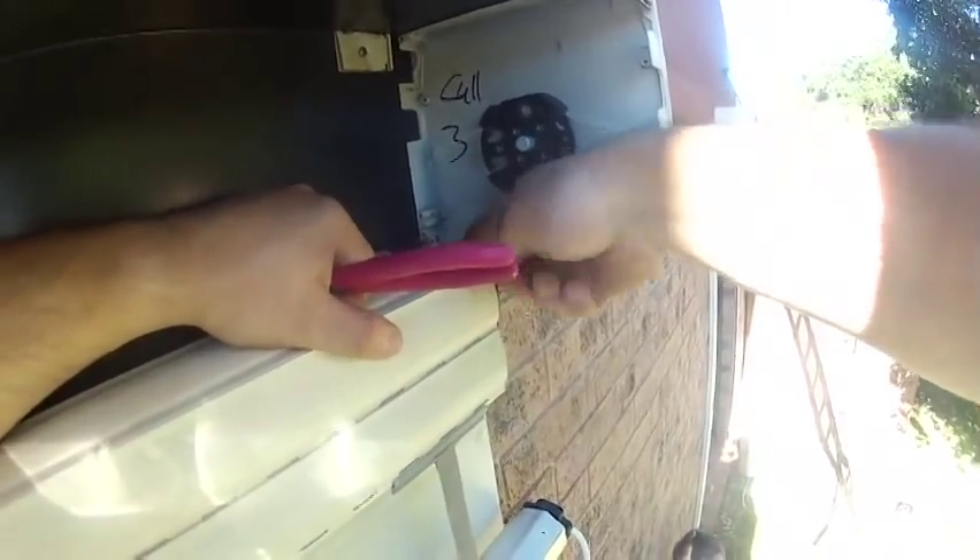Then it's just a matter of clicking the motor in. This particular system has a very easy bracketing system that just clicks straight back in. There's where your cable is supposed to be going. We're taking the motor, the top tube, the slats, and the springs up — clipping the motor head end in first and then extending the telescopic end at the other end.